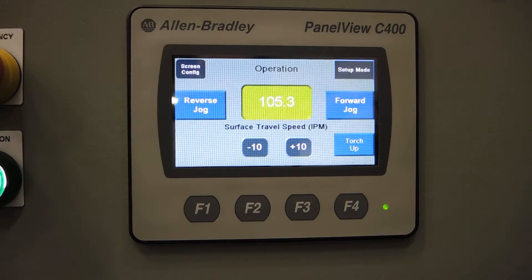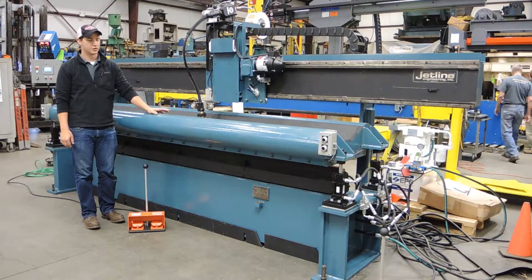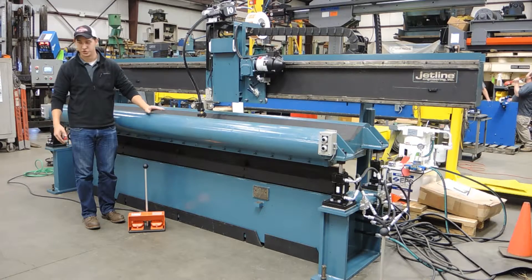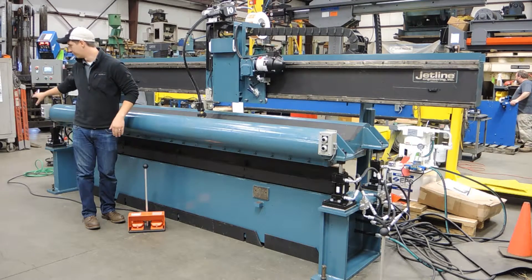That covers the controller, and we'll move on to the seamer. We're taking a look at this longitudinal seam welder that has a unique application — it has a hydraulic bed lift on it. For this unit, we've got two different locations, since it is a flat sheet seam welder, and the sheet is going to be draped across on either end for the operator to be able to load parts from one side or the other.